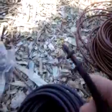So bear with me. I'm going to put my camera down. Sorry about that. I'll kind of talk through what I'm doing. Okay. There it is, connected to a 1/4-inch spaghetti tubing with a 1/4-inch coupling. Now this barb end goes into where I punched the hole, which is right here. So I'll go and punch in. Here it's snapped. That means it's in place when it snaps like that. So that's connected to the poly tubing, which is your mainline water source that goes to the valves and your Y filters and pressure regulators.